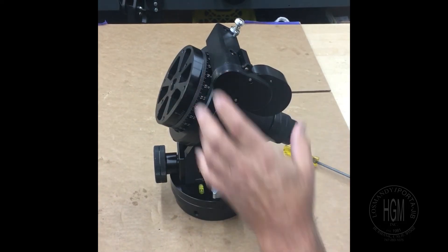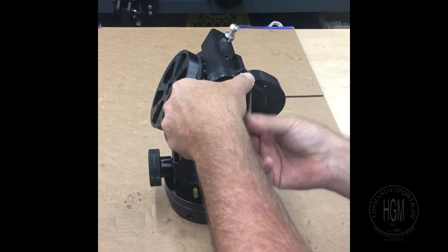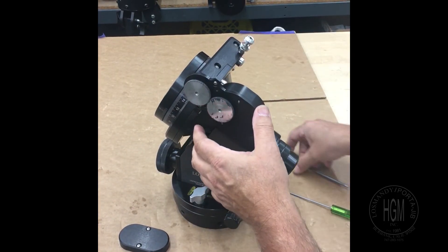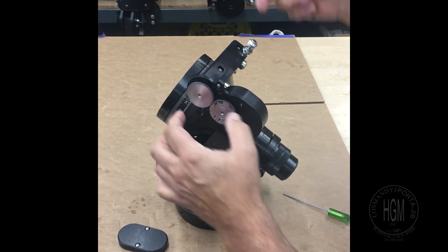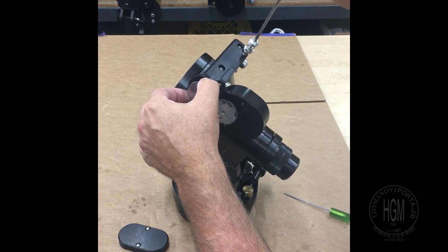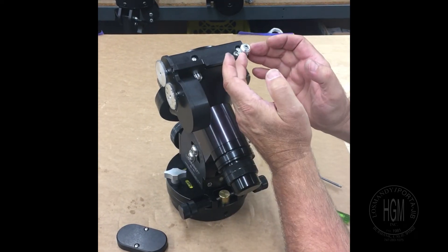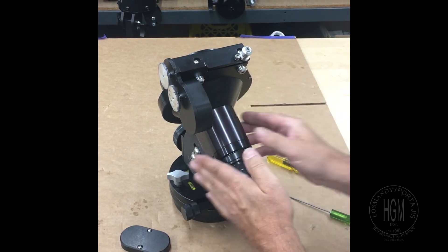What I like to do is remove the cover here and you've got your spur gears. I keep this loose and push this up so this turns really simple or easy. Then I turn this down until all of a sudden you get a drag here. What this tells me is this is when the spring has enough pressure to actually push down the sliding of this mechanism.